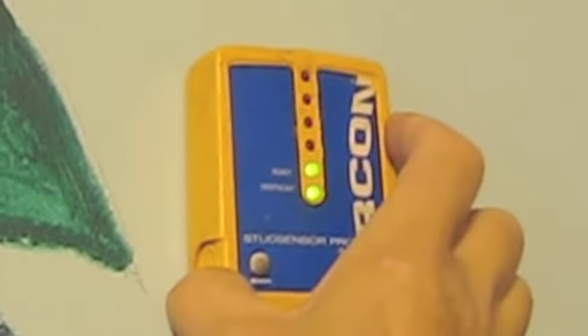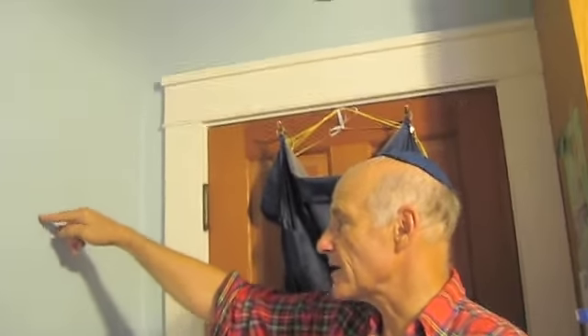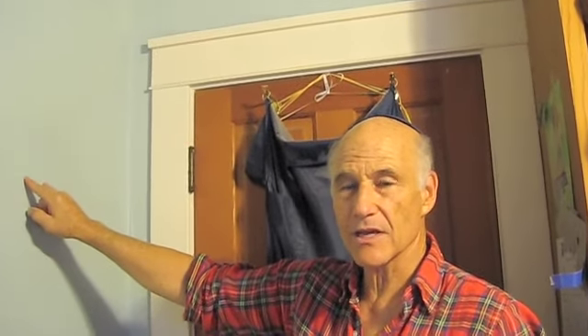Let's start from the other side. Let's assume it's going to be right about there. The stud that I'm talking about is the wood framing in the house, and in the older houses I think they are every 16 inches — I've got to check that detail, it'll be in my blog. So right about there is where the stud is. Why do I want the stud? Because I'm going to put a hook in there to hold the mirror up. If I don't find the stud, it's just going to go into plaster, and it might not hold this mirror very well, and this mirror will come tumbling down and break, and we don't want that to happen.